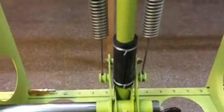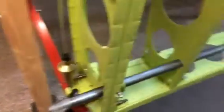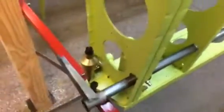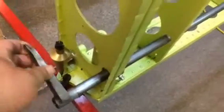You can see that I put the rubber bumpers on the tube — the support tube — and that rubber bumper allows this to bottom out there and not damage things. Basically this whole assembly here is going to rotate when you turn the lever down here. Flaps down will be this way, and flaps up will be this way. This lever mechanism is now in the flaps-up position. The rubber bumpers are there just to keep metal-on-metal contact from happening.